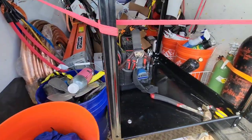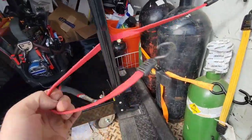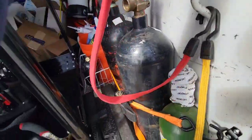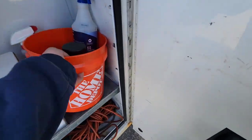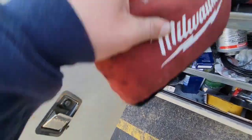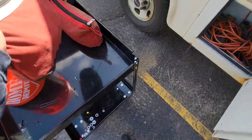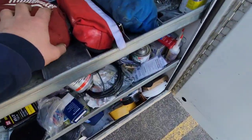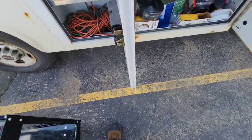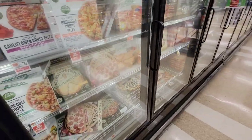Real quick, today we're going to have a case running warm and I'm going to make a playlist of this to give newer technicians a methodology to diagnose an issue. First up, the first method on your service call should be to read the call. This call description said the problem came in ten days ago. Managers aren't exactly HVAC techs, but they probably know when it came in, so there might be a work order or someone who knows something. Get the manager to show you the case.